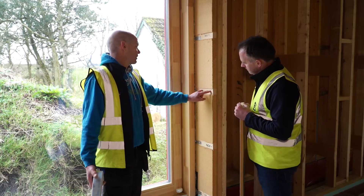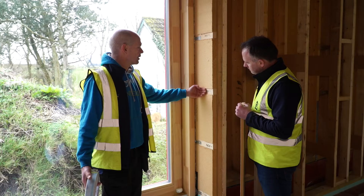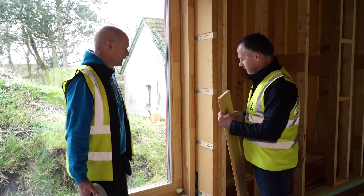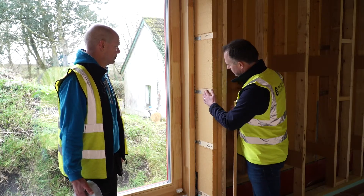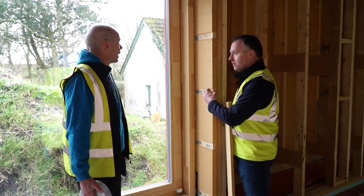And then there are those packers where I just need them, to fix the windows and as ground for my board. So that's a piece of the Gutex wood fiber - a thinner piece - but that's an insulating board. You've got your packers as grounds for your windows and as grounds also for the airtightness membrane, perhaps when you're stapling it later on.